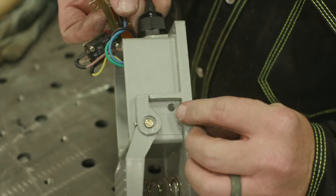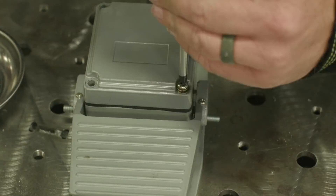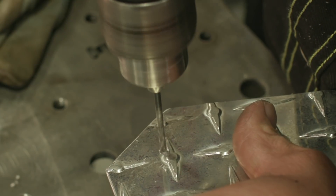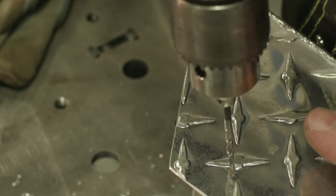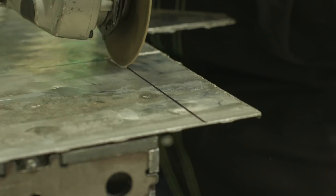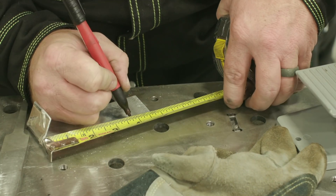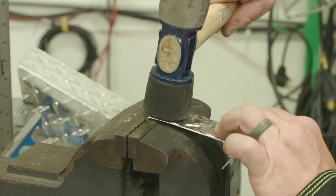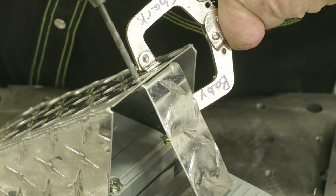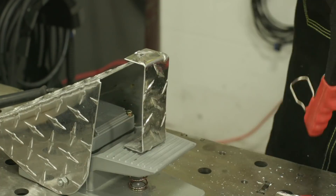In this area we're just going to go ahead and drill a couple holes through the bolts so that we can mount the foot pedal back to the shell when we're done. I'm grabbing these out so we can transfer the marks over, then we'll drill it. I did an eighth-inch pre-drill and then a quarter-inch final drill. Now we're going to cut a little strip out so we have a little bit of reinforcement to attach the pedal to our new shell — just something simple, we're not building a rocket ship here. We'll go ahead and drill these out and then pop rivet them in. We could have welded them, but since they're going into a cast aluminum pedal and then we're putting the shell on, it's just easy to pop rivet both of them in there.